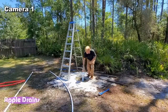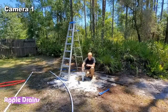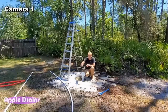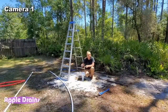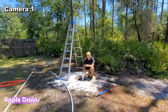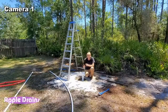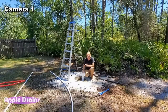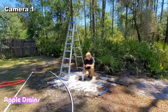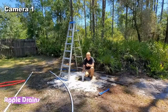And what we're going to do is we're gonna use that same 1-inch pipe, that's 40 feet connected to the discharge of the mud pump. I'm going to take this tee off, and we're going to jet that down 40 feet. Once we're down 40 feet, we'll quickly pull that pipe out, and we'll install the well point. It'll go straight down into the ground, I hope, unless it collapses. We have to do it pretty quick. But again, such a quick project to do. You need a mud pump.